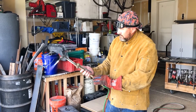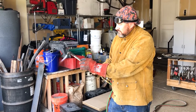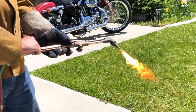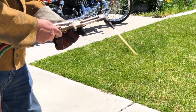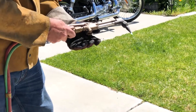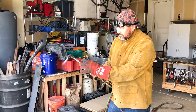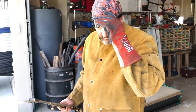So here we're establishing what's called a neutral flame. I could do another video that shows how to do that, but you basically want to get a nice blue flame and be able to add that extra oxygen, which will blow the melted metal out of the way.